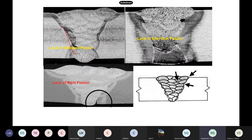The lack of side wall fusion — the weld has not stuck to the side wall, that is to the main plate. The lack of inter-run fusion also: in multi-run welding, one run is deposited, then the second run, and between first and second run there is a gap — it has not been done properly. At the root level also it has not fused properly.